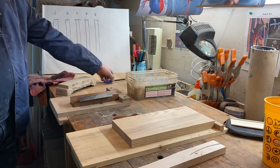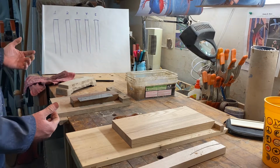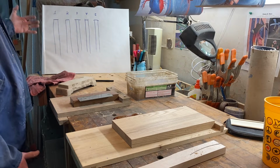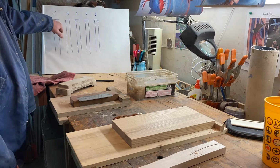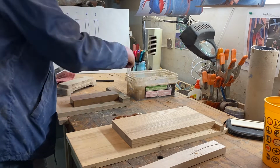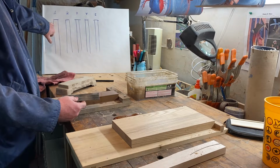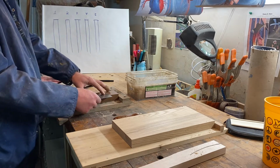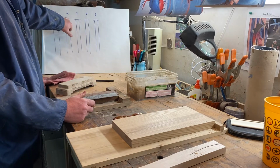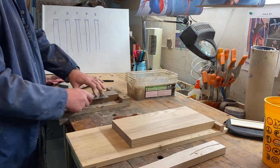In phase number one, if you can see, there are these tiny little horns here and here, and those are the residual pieces that are doing the cutting. I want to get rid of those because there's no way to elongate those or to make them sharper or better. A lot of times these things break off after use, and that's why scrapers work beautifully for maybe the first 3 minutes or 5 minutes, depending on what you're doing, but it's not indefinite. So in order to get rid of those, I need to lay the scraper down flat on the stone and just abrade those away. So we have flat surfaces here and here. I hope that's showing up in the video, but it may likely not be.